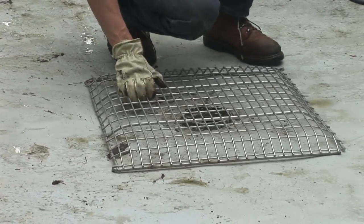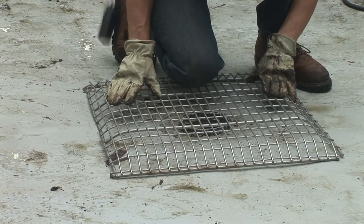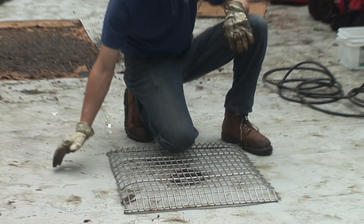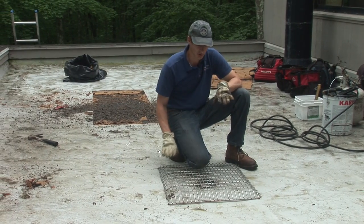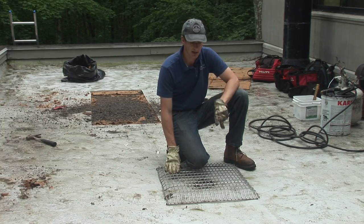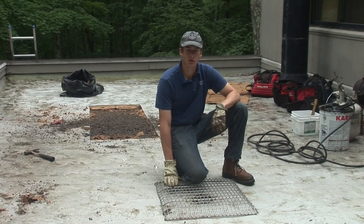After we lower the drain, this will work very well because just a few leaves stay way out here and you have a lot more space for all the water to come in still. And if they wash up over the top, the water can still get through. Small circular ones like that just don't work. So this is how we solve the issue: number one, lowering the drain slightly, and number two, putting a much wider, lower strainer on top.